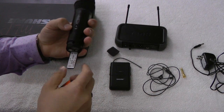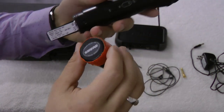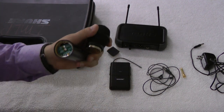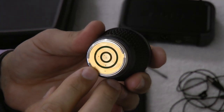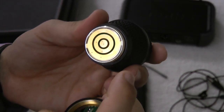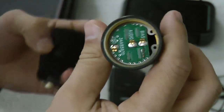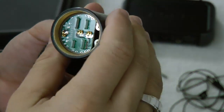We've got battery connections on the back, and usually this sort of cover comes off. So we have some electronics, which we'd expect. We have circumference contacts — this microphone needs three contacts. You can see three contacts, and regardless of how someone decides to screw this in tight, it will always make contact with one, two, or three of these. This looks pretty well built — there are some scratches on the pads, but those are just the bias, audio, and ground contacts. No problem.